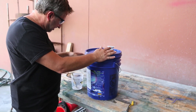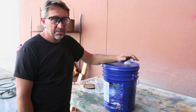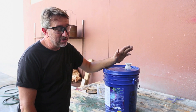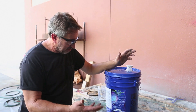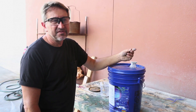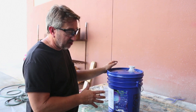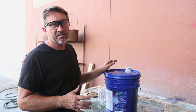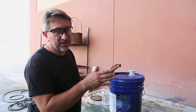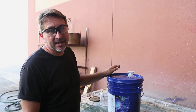This is the other alternative to removing paint — chemical stripping. Normally I shy away from this, but there is a new product: an environmentally friendly paint stripper. Most paint strippers are really nasty and have a tendency to cause problems in groundwater, but this product doesn't have that issue — you can rinse it off and it's no problem. If you get it on your fingers, it gives a mild irritation rather than a severe burn, though you'll wear gloves and goggles anyway. It works a little slower than other chemical strippers, but because it's environmentally friendly and working very well, we're trying it on the horizontal stabilizer.